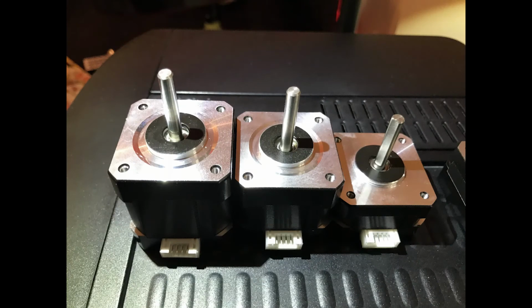One of them is called Slimline, another one is Compact but Powerful, and there is the Axis motor as well. So I have a reason why I ordered 3 motors. The motor that I'm using on the extruder isn't really perfect for that use case. It's just too big, it has too much weight, which means it has too much inertia, and it doesn't print at the quality that the extruder could print at.